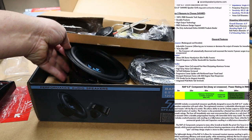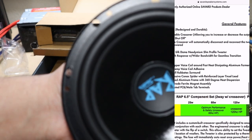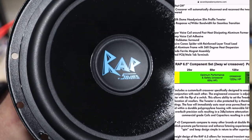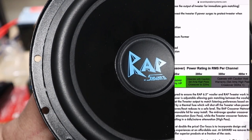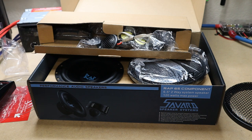As far as the woofer is concerned, it's a 1-inch copper voice coil with high-temp voice coil adhesive. And if you listened to the Kicker live stream, that's what's important — the voice coil will usually last longer than the glue, so you need that high-temp adhesive. These are pretty solid speakers.